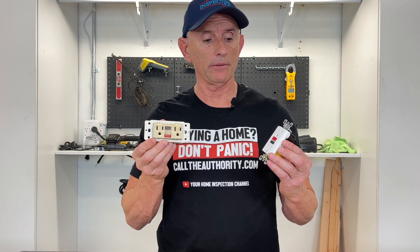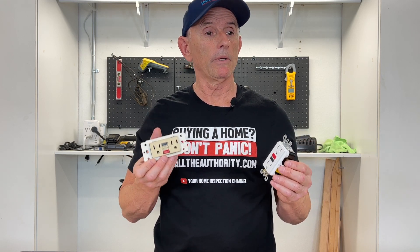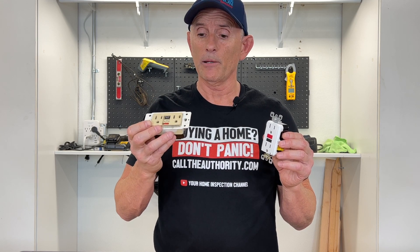So we have an old GFCI receptacle and a new GFCI receptacle. How do you know when to change the old ones? Well, if it fails and doesn't work anymore, that's a good time. But what's the life expectancy? That's kind of unclear. I looked up the warranty on this one — it comes with a two-year warranty, which gives me an indication that maybe they're only meant to last a few years. I've heard others say replace them every 10 years if they haven't broken. The older one is not self-testing; the newer one is. This newer one is awesome — it tests itself, which is pretty cool for 20 bucks. The old one was still working when I replaced it, but I upgraded some electrical in my garage and it's just smarter to get rid of it before it fails.